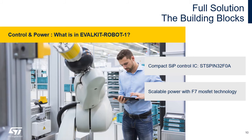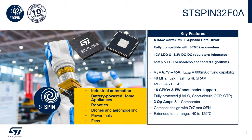Let's have a slightly deeper look at what is actually on the board and which level of flexibility these components can provide — namely the ST SPIN32F0A and the MOSFETs. ST SPIN32F0A is the specific part number from the ST SPIN32F0 family selected for this evalkit. The driving factor for this choice is the number of operational amplifiers included in the A version, which is three operational amplifiers. We decided to implement a field-oriented control mainly because of the current reading precision and lower computation power needed, which is a quite convenient choice for an M0 core. That brings in the need for three operational amplifiers for signal conditioning, making ST SPIN32F0A the final choice.